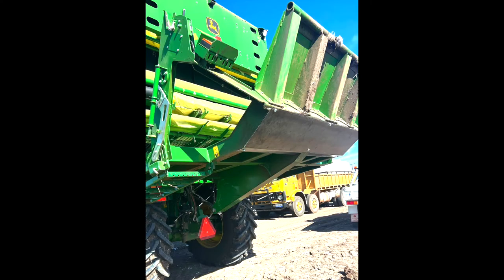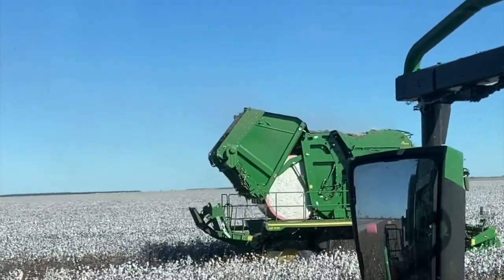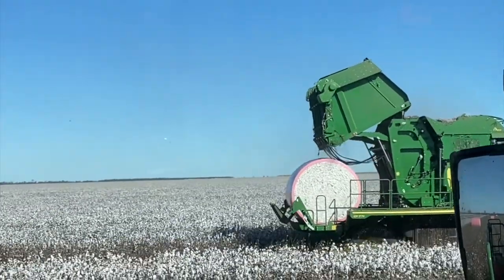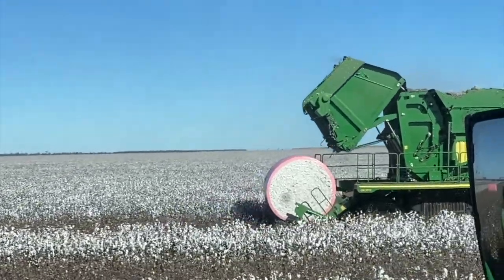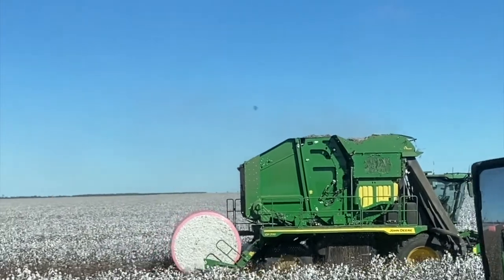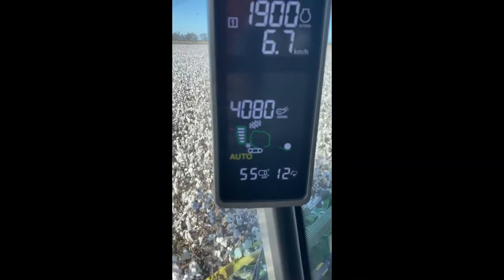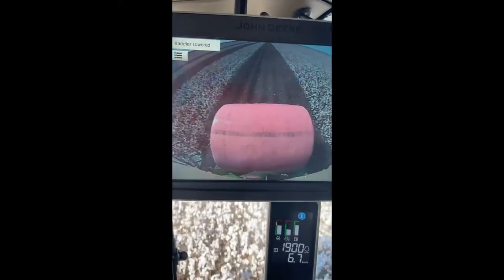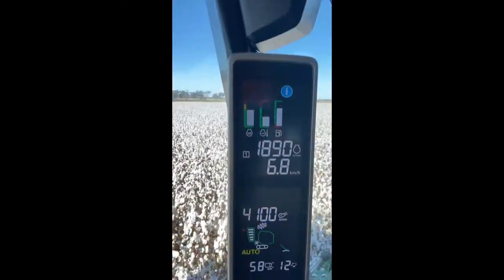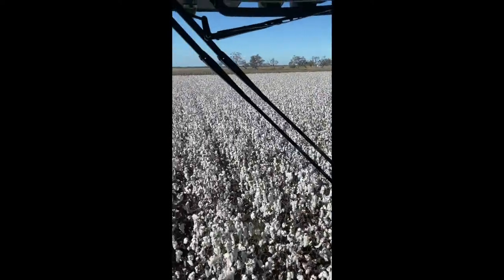The only good solution I've seen is one machine where they sheeted in that section so that it would just skim along on the ground — I'm told it worked excellently throughout the season. There was also talk that you could calibrate the handler on flat ground with a big block of wood — a sleeper underneath it — so that it doesn't push down into the soil so much. We didn't do that, but it might be worth a try. We were catching it with the up arrow just before it touched the dirt — press down then catch it just before it touched down. While that did work, the modules were often slow to roll off and sometimes you had to press it down a little bit more. It was just another thing to train where you want it to be simple: a full down press, and once the module's gone, a full up press.